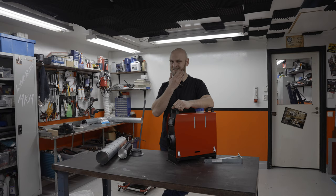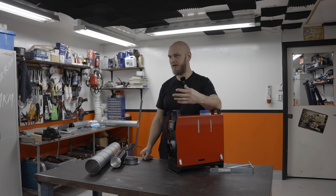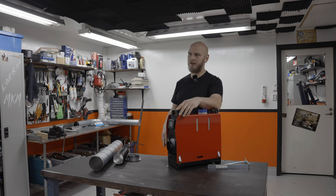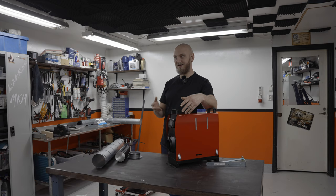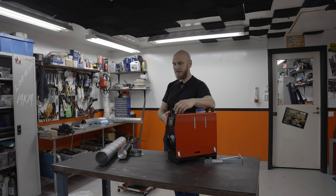So the problem that I'm imagining here is that, let's say I bring a car in here, the garage is hot, the car is full of snow, it's frozen, I bring it in here overnight, it's going to start melting off, it's going to get very humid in here. Then the next day, maybe I want to bring the heat up again, so I'll turn this baby on, and then it's going to start sucking that cold, humid, wet air into the pipes here in order to send it outside to the heating unit. And I think I would run into a lot of condensation issues.